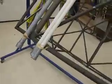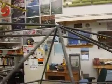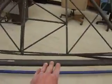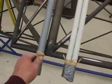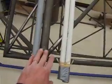What I like about this particular design is I can take these tubes that are full of lead and just take them loose and move them. Let's say if I'm here welding these clusters and moving my way forward and need to weld in here, it's really easy to just take these rubber bands loose, scoot this whole assembly over and move them over. They'll still be up on top and provide counterbalance, but they'll be out of the way of my welding and the heat, so they're not going to melt.